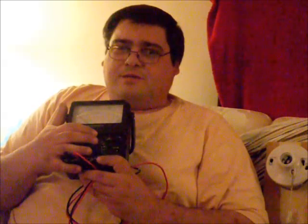One of the things you need most importantly is going to be a good multimeter — really, it doesn't even have to be a good one, any multimeter. I've had this one since I was a kid and this is what I use. It's an analog meter, but you can get a cheap digital multimeter. Harbor Freight has one that's usually on sale for $1.99. It just needs to be able to read voltage and maybe do 10 amps. This will allow you mostly to test your batteries and see what voltages are, and you can also put it on a continuity or ohms resistance test to make sure all of your connections are making good connectivity.